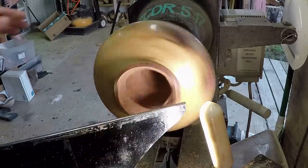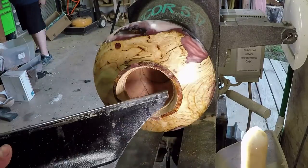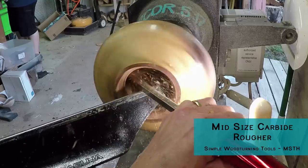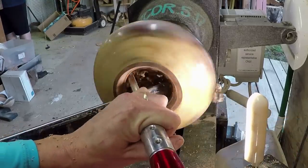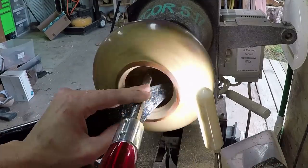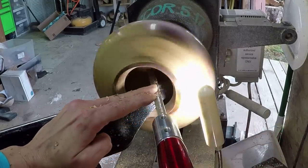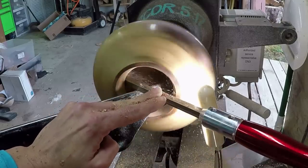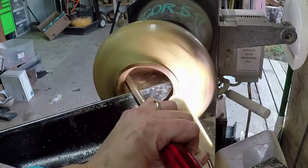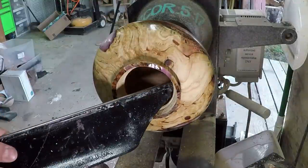It was very awkward to cut in that hole, and it was still wobbly because of the imbalance between the resin and wood, so I couldn't turn very fast. Vibration isn't good when cutting punky wood because you're just beating the wood out of it. I'm using a mid-size carbide rougher to take out more material at once, switching back and forth between that and the hollower. It's not hollowed out really thin — my hollower wouldn't fit any further, and the wood was very punky. I was afraid going too thin would cause cracking or instability. It ended up a little less than half an inch thick.